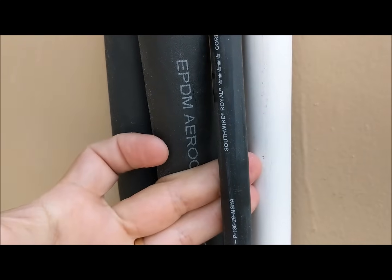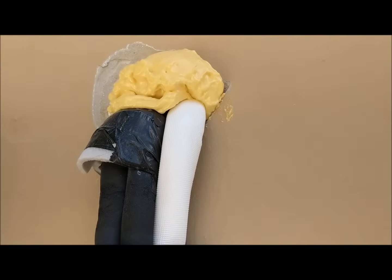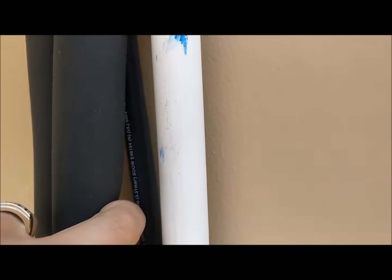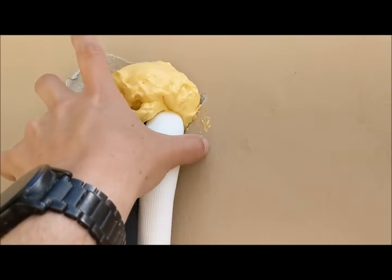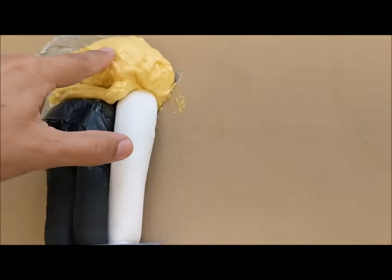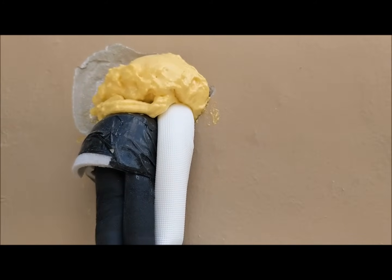This wire right here — it looks like a 220 wire, but what it's actually doing is sending the electricity from the indoor unit that's already plugged into the wall. Remember what makes this unit so unique is that it is 110 volt — you can just plug it into any standard outlet. This wire sends the electricity to the outdoor unit. It's very important that you also use spray foam to keep bugs from going in and humidity and moisture out.